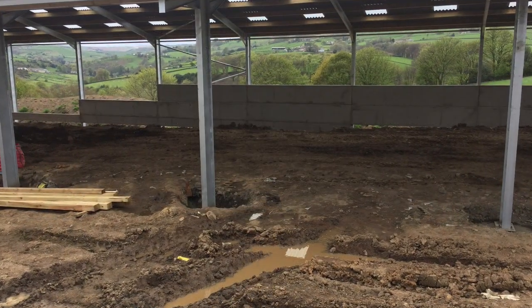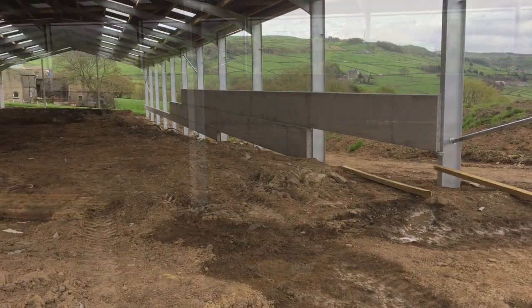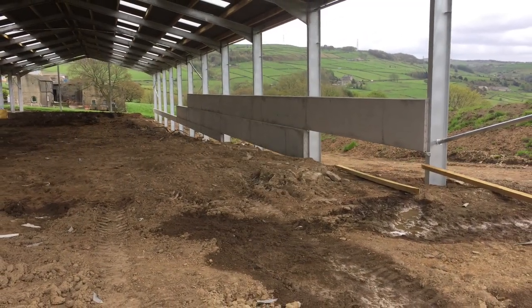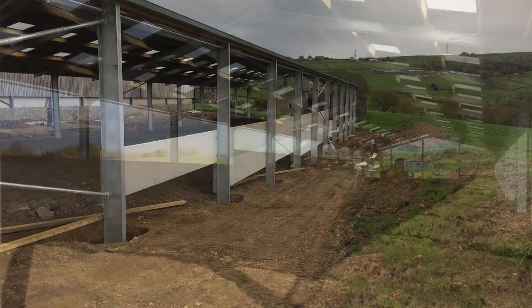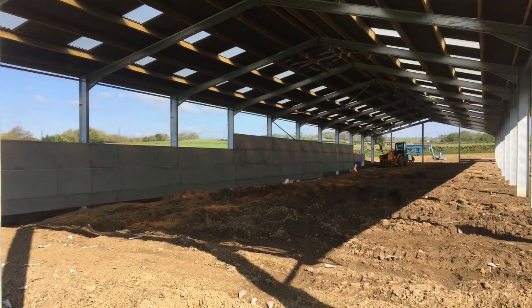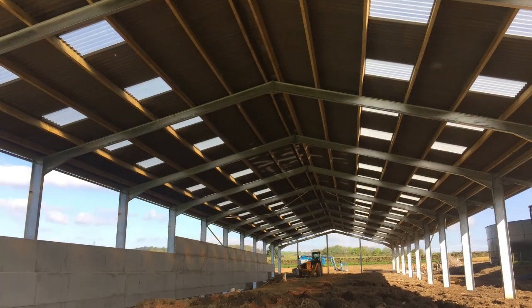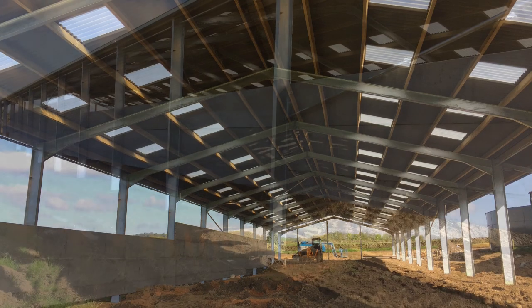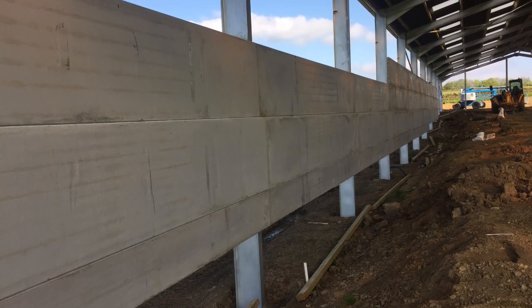Fitting the concrete panels is a very straightforward operation. The panels simply sit onto some angle iron and are held with plates on the rear. The uneven ground is now quite apparent — as you can see, we need quite a large amount of fill to make the floor level on the internal, and it will also be backed up outside with the topsoil and fill we saved earlier. There was approximately two to three meters of fill to go in up to the panels.